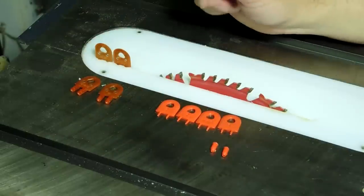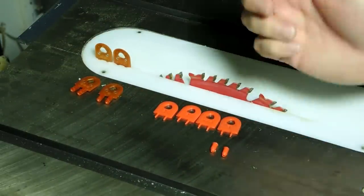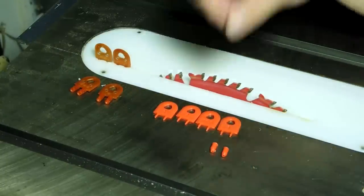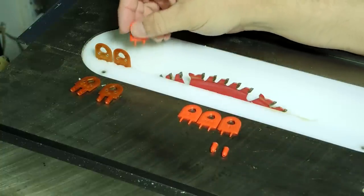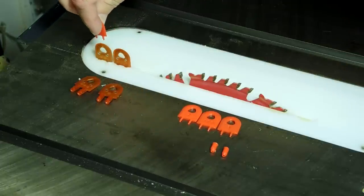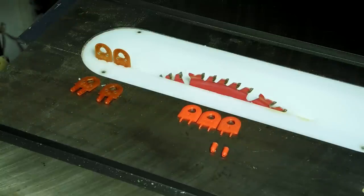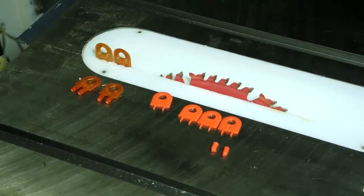This kit also comes with some plastic ones called kerf keepers. What you do is take out the metal splitters, insert two small spacers, and the kerf keepers sit loosely in those spacers. When the board passes past the blade, if the kerf pinches the kerf keeper it will actually pull it out of the hole, and it will travel with the end of the board to keep the kerf open all the way across. Read all of the instructions so you understand how all of these work.